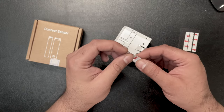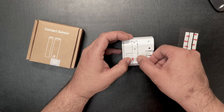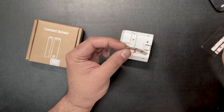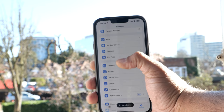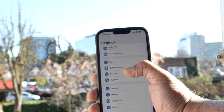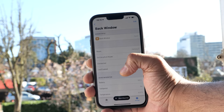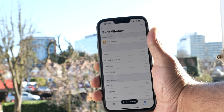Installation overall took me around an hour without help from anyone else. This is because all the components run on batteries and are connected using wifi, and the battery should last around 12 months, making the system easy to install. The Boundary app is very well thought out and full of information. You can add rooms, sensors and name everything. At a glance you can see if each sensor is connected, triggered, tampered with, the battery percentage and the temperature. You can enable the LED on each sensor too and assign whether or not it is on the entry and exit route.